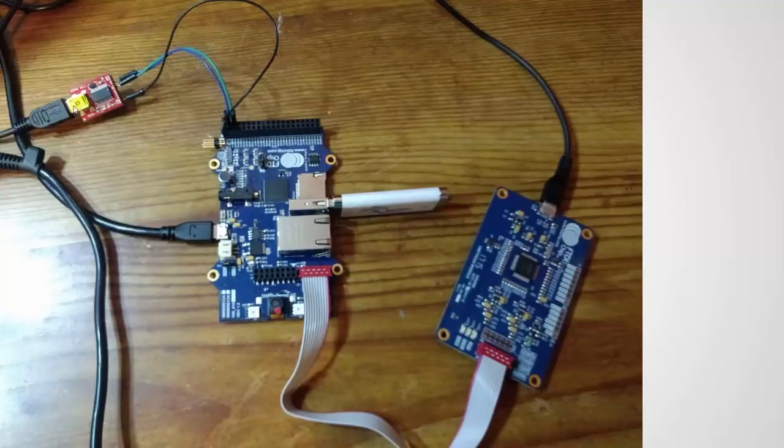I'm using a SparkFun USB to serial interface for this example. I'll use a serial monitor — specifically the Arduino serial monitor, but you can use any serial monitor like TeraTerm. I'm going to write data in the serial monitor, feed back informational data from the chip, and everything written from the serial monitor will go to a file on the USB thumb drive.